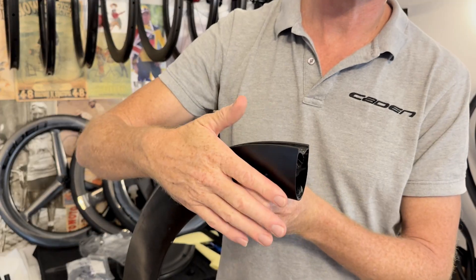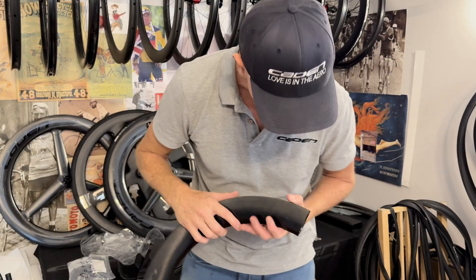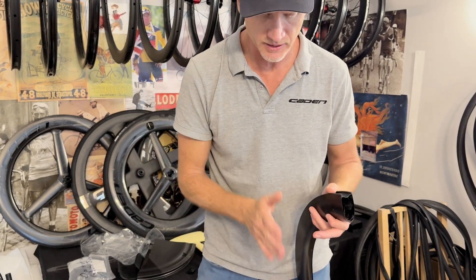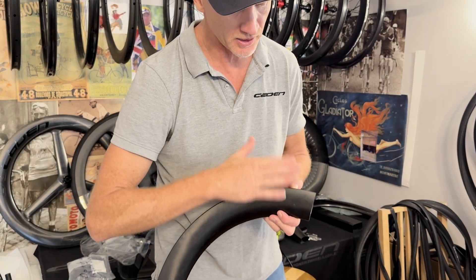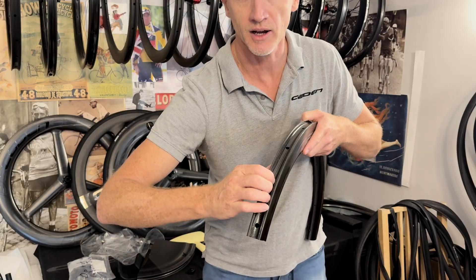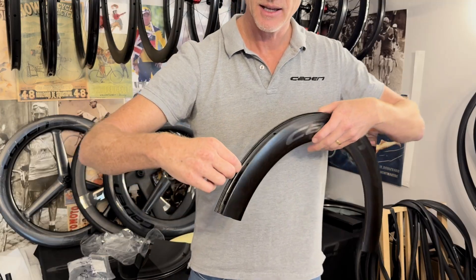That's the key difference. It's a bit like the grain of a block of wood - if you've got the block on the end and you hit it with an axe, it'll split the wood open. Whereas if you put the block on its side and you hit it, it won't split. So if you've got fibres coming up at 45 degrees, which they do in a normal wheel, and you hit it on the end, that's like hitting down the grain. The moment that grain folds over, you're hitting the grain on the side, and that's a massive difference to impact resistance.